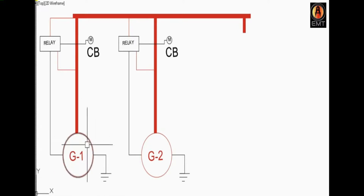We can do this for generator 1. We have to do it here — use the relay to make a manual check. We have to do it with the stop button. When we do a manual and press the stop button, then we have to do a breaker trip. We have to do a cooling time of one or two minutes.